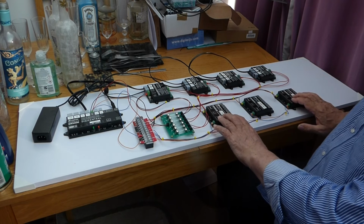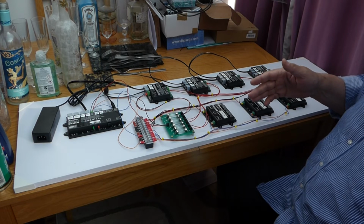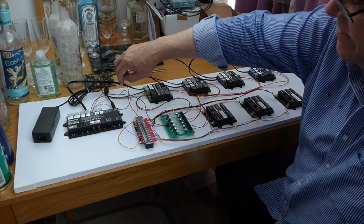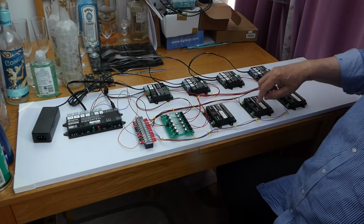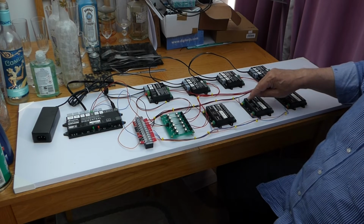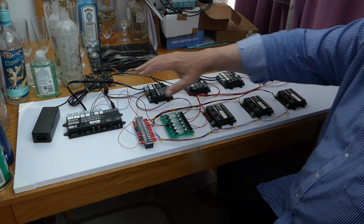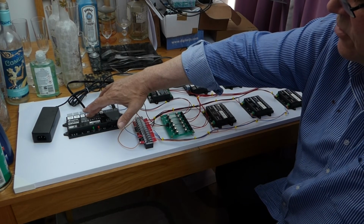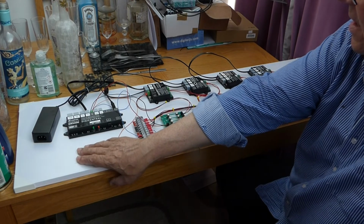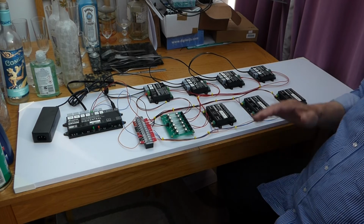Getting back to the point change, the idea, what I've seen the way it's wired on the internet, is that the signal wires come out from the unit, the Digi Central. They come up to the 4018s into the signal, then people loop it out the signal and onto the power. But I've also seen recommendations to keep those separate. So yes, the signal will feed back from the DR5000 Digi Central, but the power feeds through this block and it will have its own power supply. Keeping it separate, hopefully. I don't know what the reason is. People have obviously had problems with it, but so I'm going to follow that.